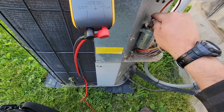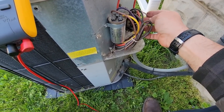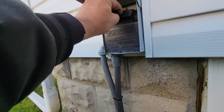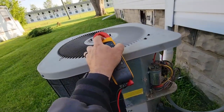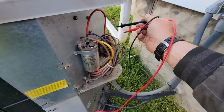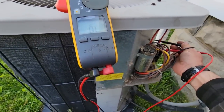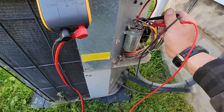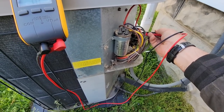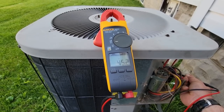That's not good. She said sometimes it runs, sometimes it doesn't, and when it does run it doesn't pull very well. Before we go further, let's check if we've got anything to ground — just kind of a preliminary check here. Nothing to ground, and this is checking everything including motors. Nothing dead there. Let's check between terminals and see if we've got some normal-looking resistance.